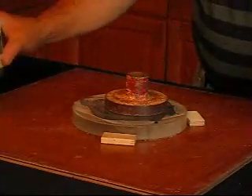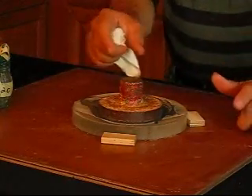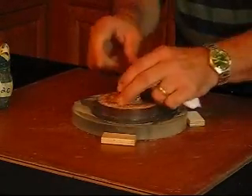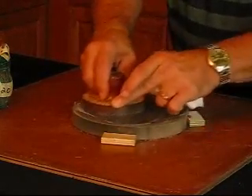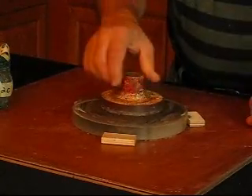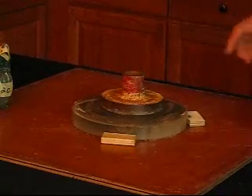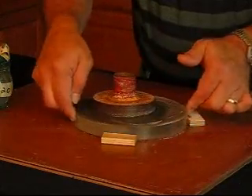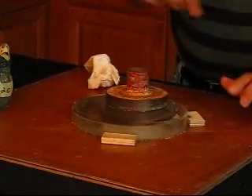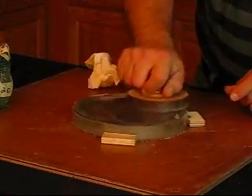Like I say, this is messy. You want to do W strokes. You don't want to go off the edge because if you go off the edge you're going to start working against yourself — you want to take all the glass out of the center. So you want to do a W stroke like this. And if you're working outside or you've got a barrel that you're setting this on, you can simply walk around your barrel. If not, you want to rotate your part. You want to keep it rotating so that everything evens out — you don't want to grind too much off of one edge. So you just keep this process up.